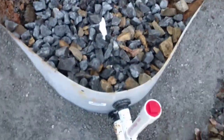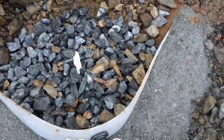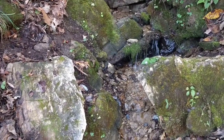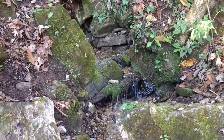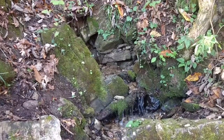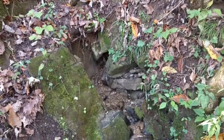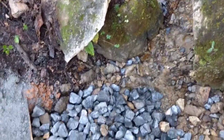In the back of the collection system right here, I had put gravel in on top of my clay that I used to seal the bottom. I'm going to continue to backfill with gravel all the way back to where that water is coming out of the mountain. You can see how this is undercut so bad - I really would like this collection system to be a lot closer to where the water is coming out, but really my only option for putting in a dam given all the rocks and the way it's laid out. You can see right back there where it's coming out, runs down over and into the back of my spring head.